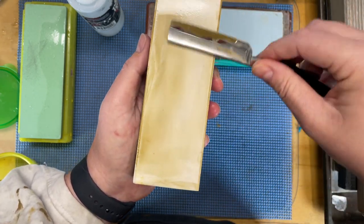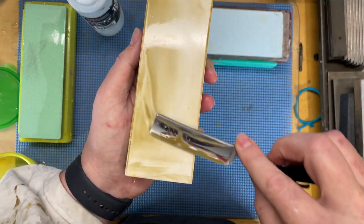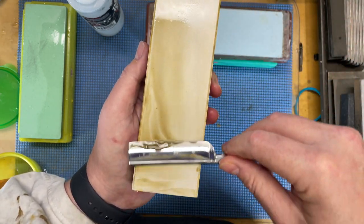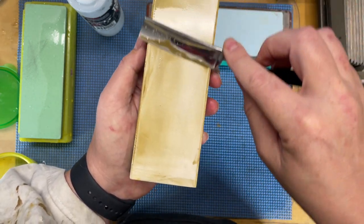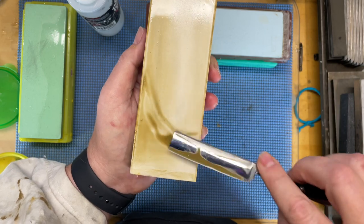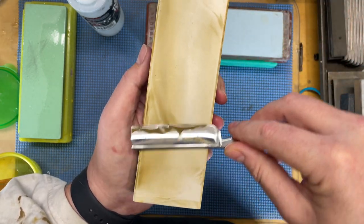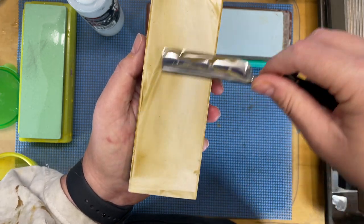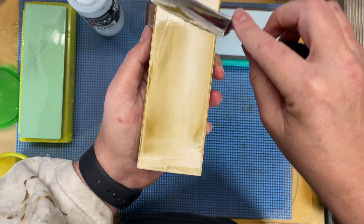And as you can see, this slurry that I had built is really darkening up. That's not rust. That's not oxidation. That is material I'm removing from this edge. And I will tell you, anywhere between 5 to 10 minutes is probably good. I'd like to stick to about the 10 minutes per stone to get you a good feel for how well you're removing that material. So, all right, back to time lapse.